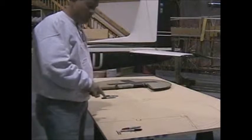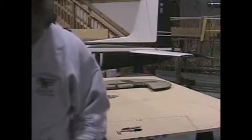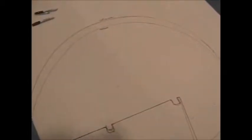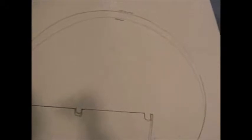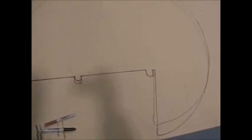I've drawn out the two and we'll take a close-up and look at the difference between the two - kind of interesting. Basically, the red outline is the original rudder and the black outline is the replica rudder. You see a longer balance out front and less rudder surface area, because effectively there's less rudder - the overall dimension is the same. You'll notice the hinge points almost match up perfectly. Now we'll trace out the original and look at its dimensions.